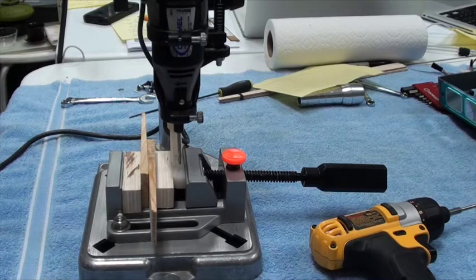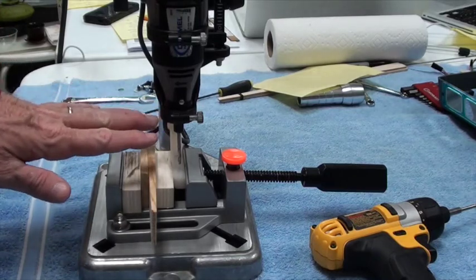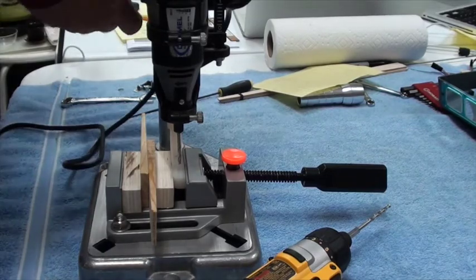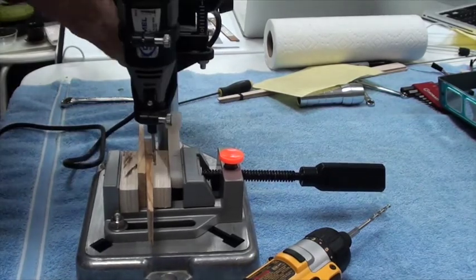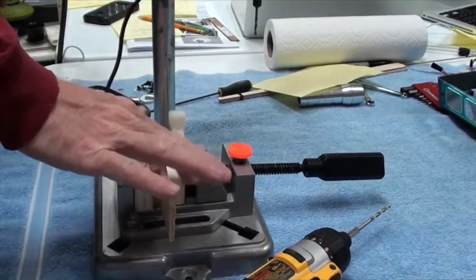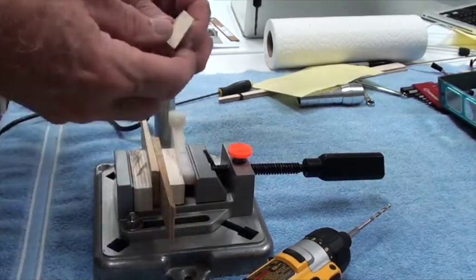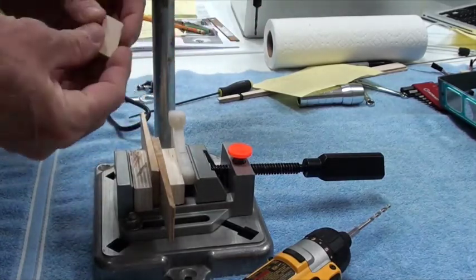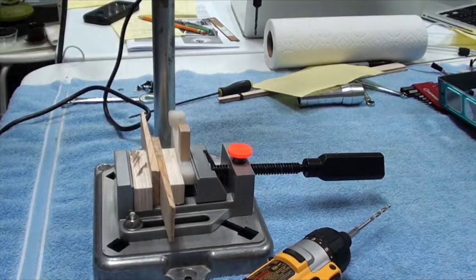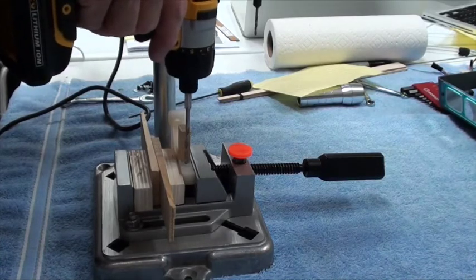I'm back, and while I was off camera I had a brilliant idea: while this thing is all good and mounted, I don't want to break it down until I actually drill the final hole in it. So I'm going to go ahead and drill the final hole now. This is all nice and flat, which gives me a good steady place to do it. I have a little wooden block here that's square that I made. If I'm going to drill a hole and I want some guidance as to whether the drill is vertical — of course I've got a pilot hole here, so that helps — that little wooden block helps me get started.